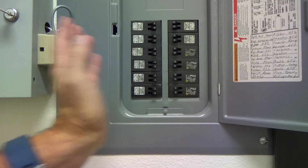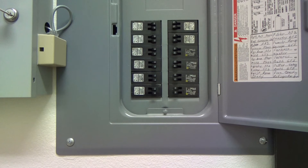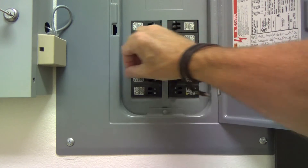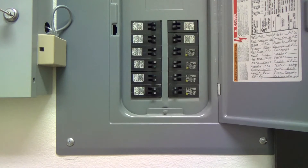Some people don't realize that if any breaker trips and you can't turn it back on — I had a friend of mine call me from Maui while I was on the mainland. He said, 'Hey Joe, we can't get our lights back on, everything's dark, power's off to the bathroom.' He was trying to turn the breaker back on but hadn't pushed it hard enough to snap it off first. Sure enough, he turned it off, then back on, and it snapped on. It had only tripped because they'd plugged in a hair straightening iron and a hair dryer at the same time, which overloaded the circuit. I walked him through it and he was able to turn it back on.